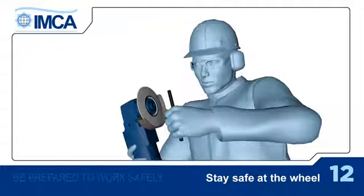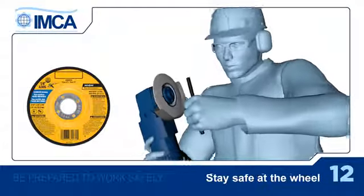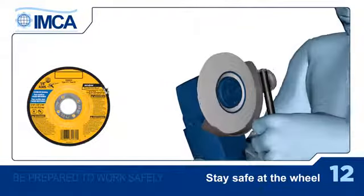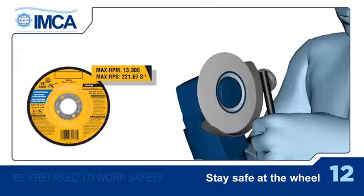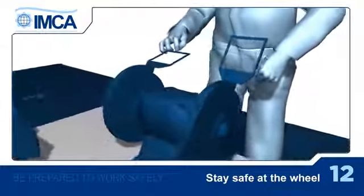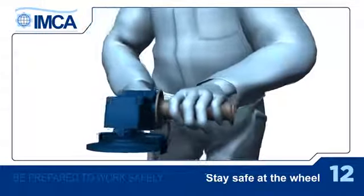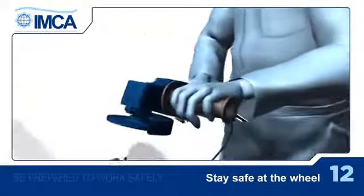Make sure you have the right tool and the right kind of wheel or disc for the job. Never grind with a cutting disc. If the wheel or disc doesn't have a maximum RPM marked on it, don't use it. Don't modify or remove factory-fitted guards. Be careful not to over-tighten the spindle nut. If the tool has an auxiliary handle, use it.